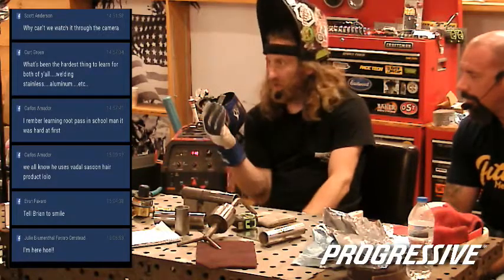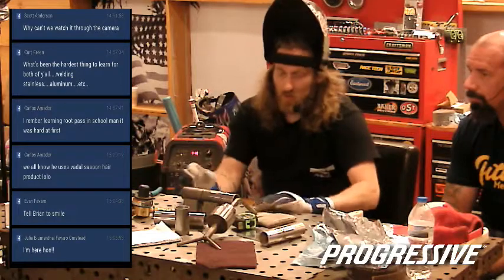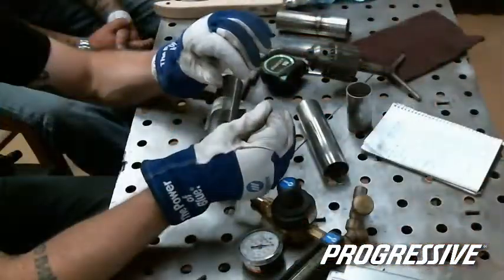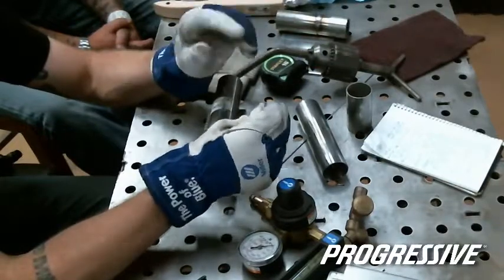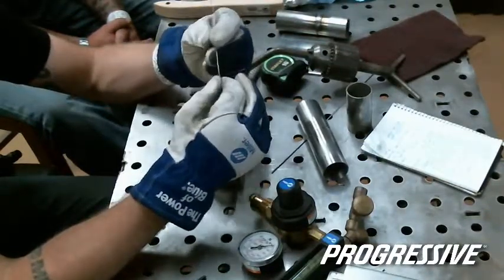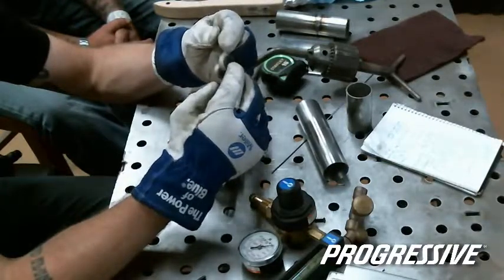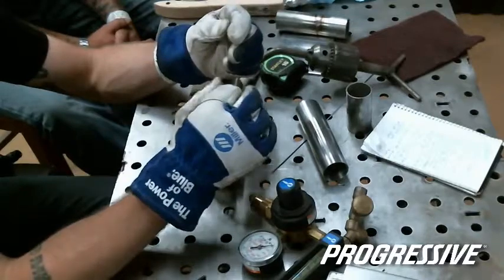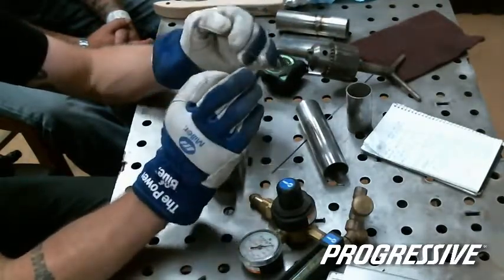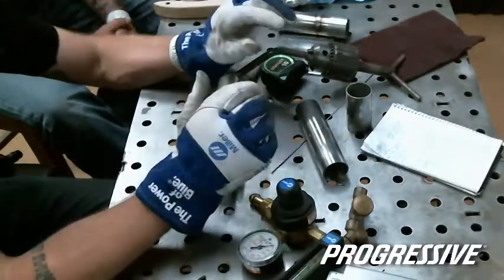So you were asking earlier about rod size too. I brought this, it's 20 thousandths, like spaghetti. Like, what's that, angel hair? Yeah. So if you're fusion welding your exhaust, this adds such a minor amount of material. If you have a spot that's not fitted perfectly, you just have to dab it when you get to that point, just as fill. And it could be bad enough to where you have to use a 16th rod.